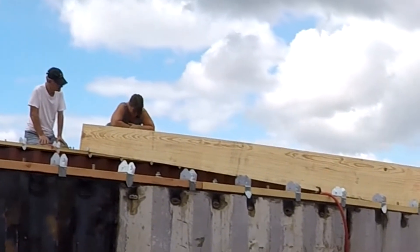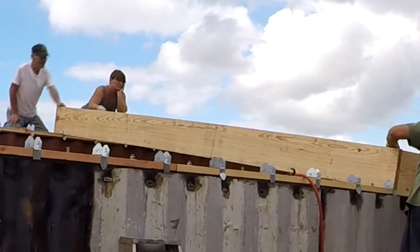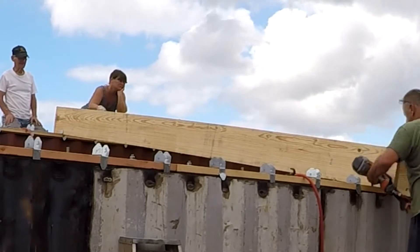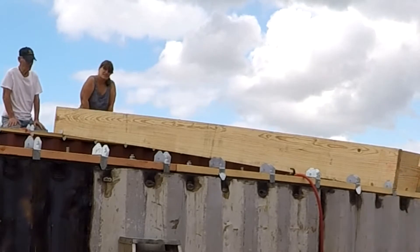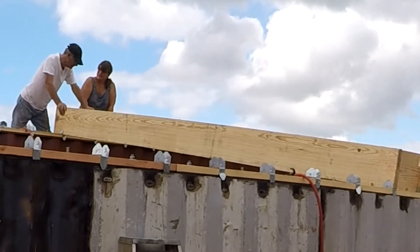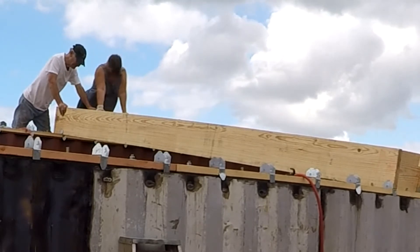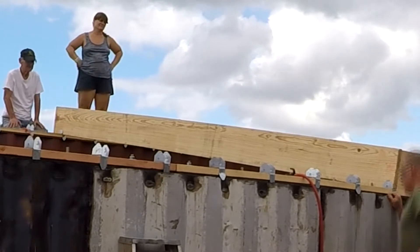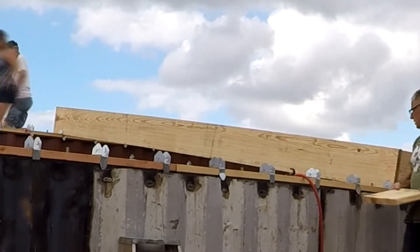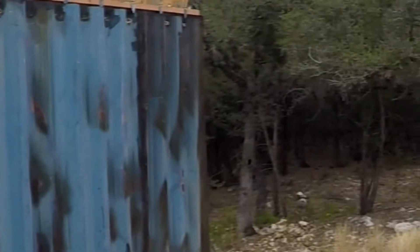Pop showed up the next day, and Angie, Pop and I did about 16 rafters that day. I'm doing all the blocking on the bottom side; they're up top doing all the nailing with the palm nailer. I'm using the nail gun. You can see the ridges, the kickout recesses for the 2x4 that come out for the overhang for the roof. That slowed me down a little because I had to cut each one as I went.